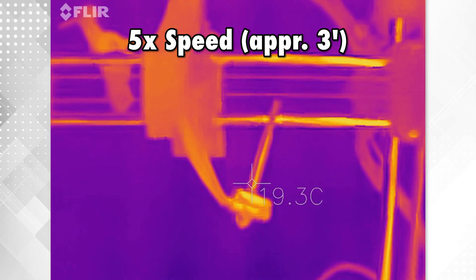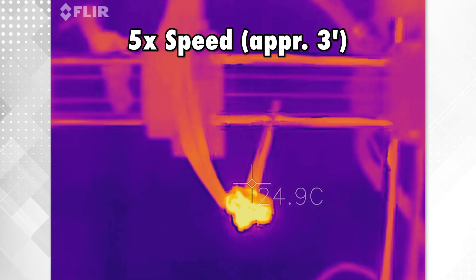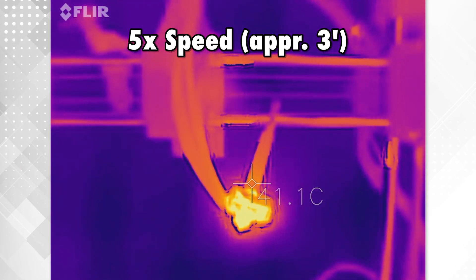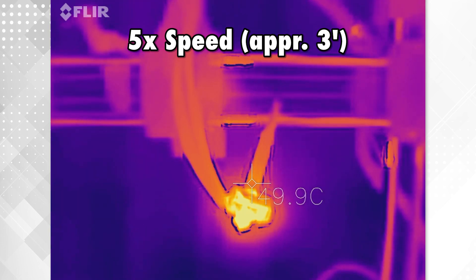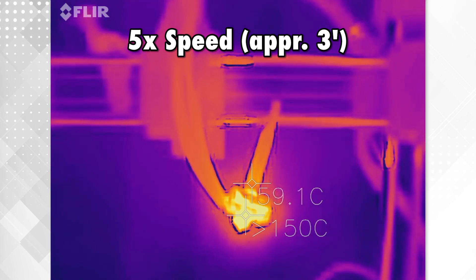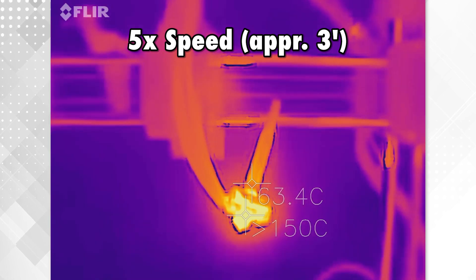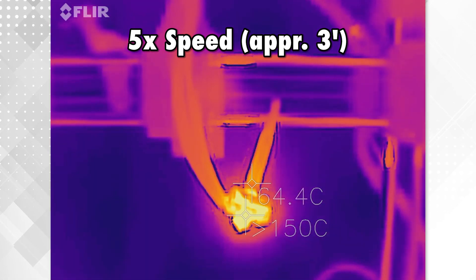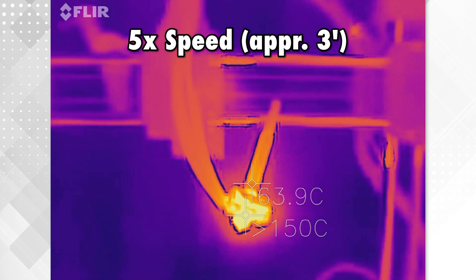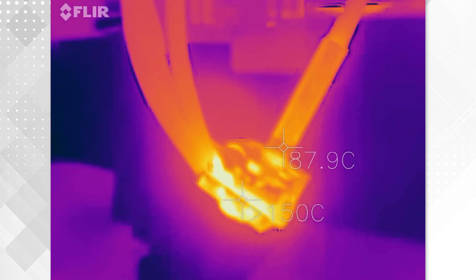So this is the first take. I heated up everything to 200 degrees and you see the temperature starts to climb. The spot you see here is just above the Heatbreak — it climbs up to 45 degrees and counting. We're above 150 on the way up; the set point is 200 and it settles at around 65 degrees in approximately three minutes and stops there without going much further. Please remember this is done without the fan, so the final temperature in the real machine will be lower.